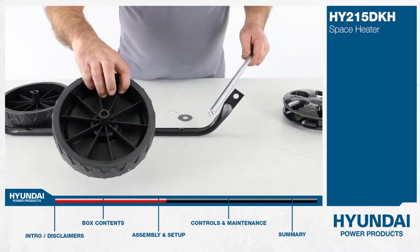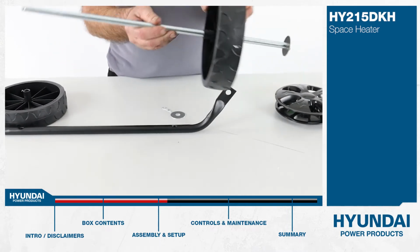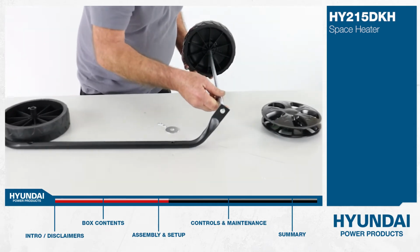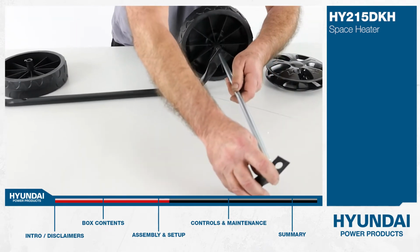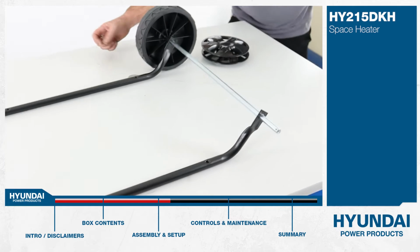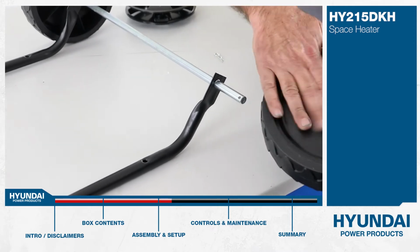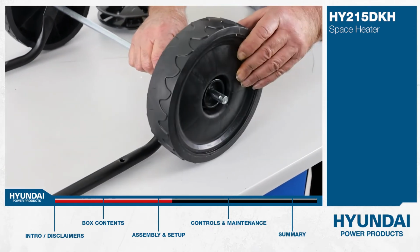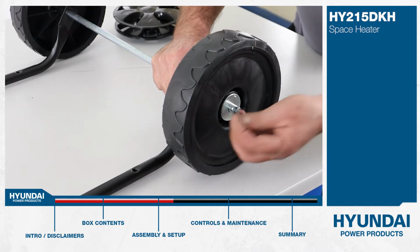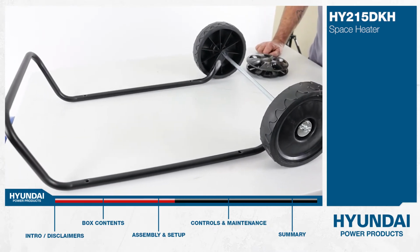Then I'm going to take one of the wheels and this high point is going to be facing inwards. So as you can see the high point there on the wheel, that's the assembly for one end. So I can simply feed the whole lot now through the frame, bit of a squeak, out the other end, and then again, on with the wheel. High side in, you can see it's flat this side, shaped on this side, wheel in, then a washer, and then the final R-clip. There we are, and that's the sub-assembly of the lower frame, axle and wheels done.